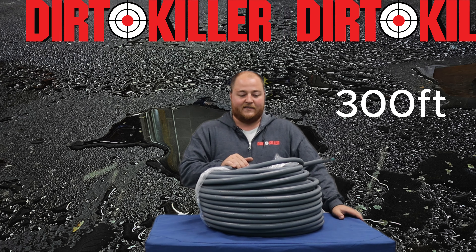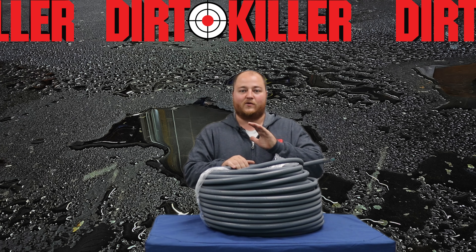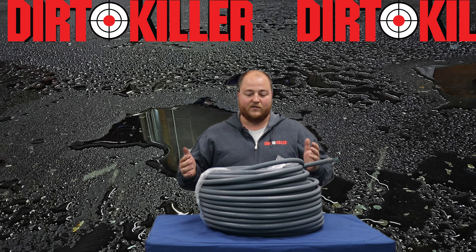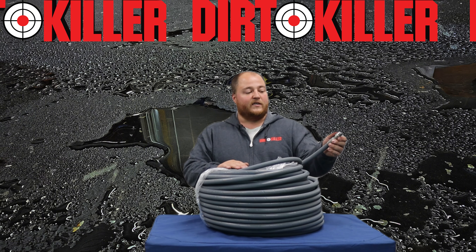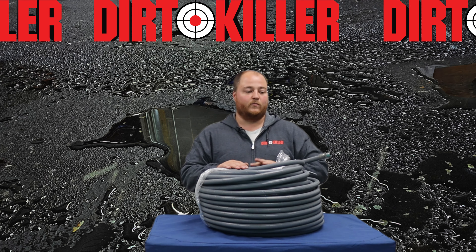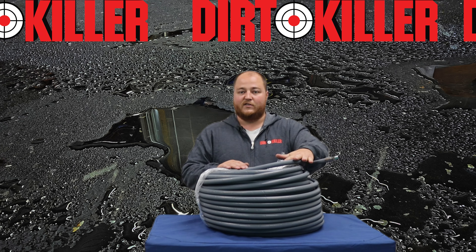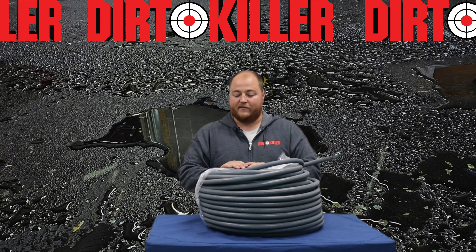All 300 feet of linear length is really just impressive to wheel around. I wouldn't recommend putting this on a standard pressure washing hose reel, but this spool could go on a high-pressure hose reel if you're looking to do something like long-distance jetter runs where you need a half-inch hose due to the volume of water you'd be moving. Standard on this, you'll see half-inch crimps on both sides that swivel. One end goes right into your reel — most of those manifolds are going to be half-inch — and then a half-inch jetter nozzle can be installed right to that. There's no bend restrictor on this because the whole purpose of the jetter line is to be able to bend and be malleable to go around tight corners.